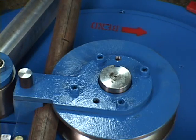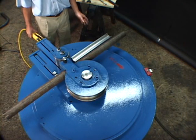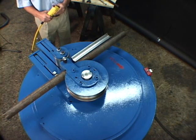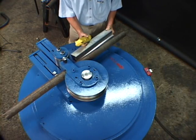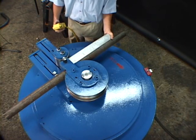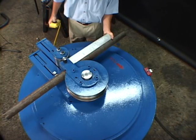So we're ready to make a 90-degree bend 30 inches from the end of the pipe. We've calibrated the bender for a 90-degree bend, and we have a limit switch preset, so we can let the machine run out to the 90-degree setting and come back and stop. We'll place the shoe up against the pipe again, once again making sure that your hand is nowhere near this pinch spot. Hold it out on this end, place it up to but not touching the holdback clip at the tangent point. Hit the forward button.